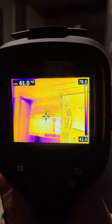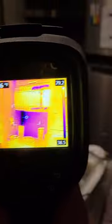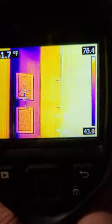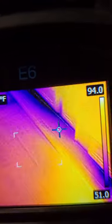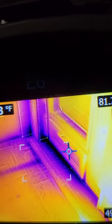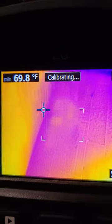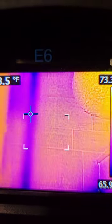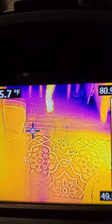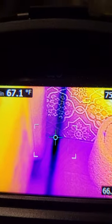Overall the kitchen is pretty good, just the corners of the slide, and again we've got the framing members. Right on the bottom edge here there's a lot of cold — it looks like it's seeping out of the closets. You can see where the cross beams on the RV frame are, indicated by these lighter or darker lines here. Those are about 67 degrees.